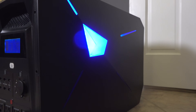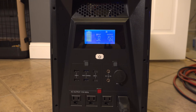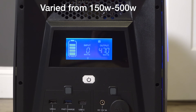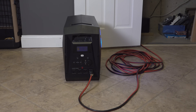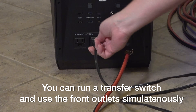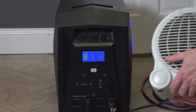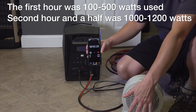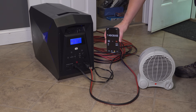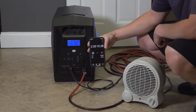You're never going to be able to run electric heaters for long with any type of generator because they consume a massive amount of fuel, but most people don't have electric heat. I connected this battery generator and ran it with my fridge and heat on, but I wasn't drawing enough power — the test was going to last about 12 to 14 hours. So I connected an electric heater to the front of the unit, boosting the draw from about 150–400 watts to about 1,100 watts. That was a continuous draw and I could run it for about two and a half hours. But remember, with just my heat and refrigerator, it would have run for well over eight hours — that's really impressive for a small unit like this.